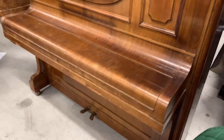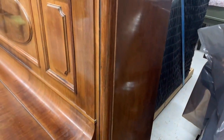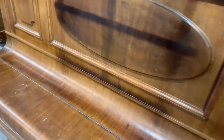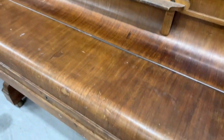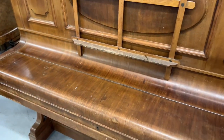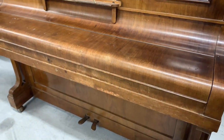Let's have a look around. The sides are not too bad, although the bottom is definitely marked with probably a removal mark. You can see how the fade lines come because of the music stand here. The music stand itself is in reasonable condition. This could obviously be improved a lot with maybe a couple of days' work, but to be fully re-polished would be ideal. French polishing takes about 60 hours, so that's very time-consuming, but a tremendous result at the end of the day.